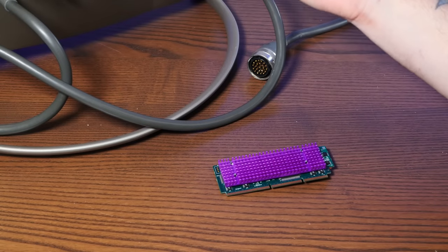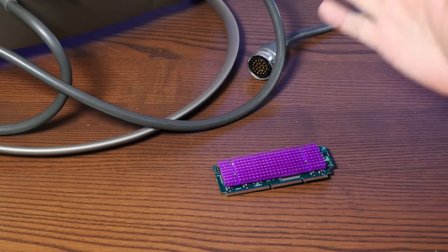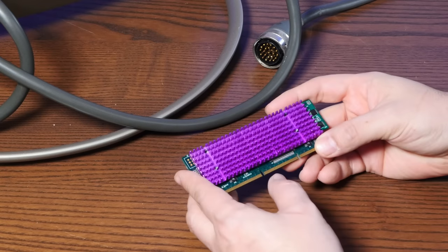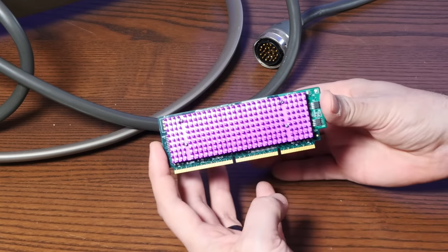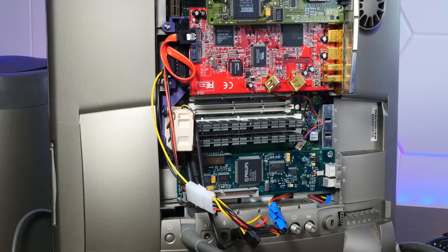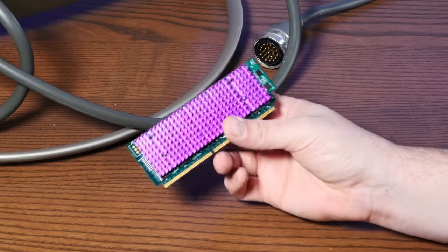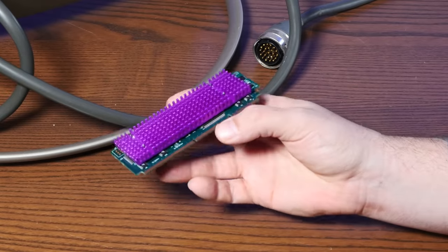The processor in machines like the 6500, and by extension, the TAM, was never meant to be upgraded. And in fact, Apple kind of specifically designed it to not be upgradable. However, back in the 90s, companies like Sonnet had kind of an arms race on upgrading otherwise non-upgradable Macintoshes. And for machines based on this motherboard, they came up with this, which doesn't actually replace the processor on the motherboard, it bypasses it. This installs into the cache slot, which otherwise would be just a cache card, and via an extension in classic Mac OS, the machine initializes this processor, forgets about the old 603, and then just runs off of this.